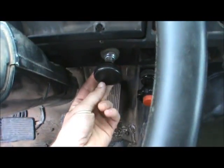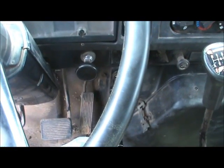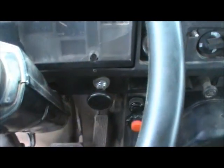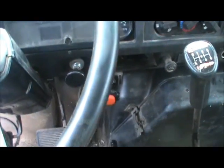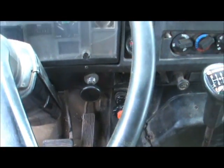Six-speed transmission with a low gear. This right here is your PTO. What that does is it kicks in your hydraulics. These things have diesel engines and a transmission, and the PTO is bolted to your transmission. When you engage this, you pull in the clutch and pull this lever out. It engages that PTO and starts spinning, which turns a hydraulic pump. And the hydraulic pump actually moves all the stuff in the back — the compactor, the cart tipper, all that kind of stuff.